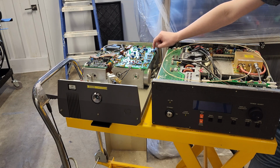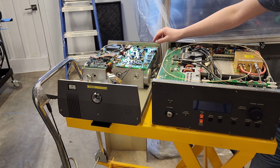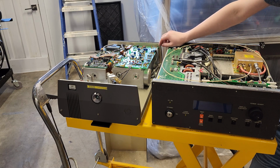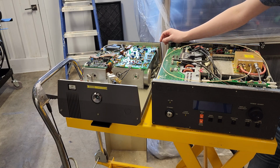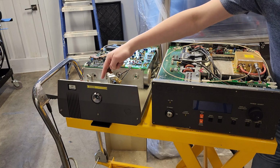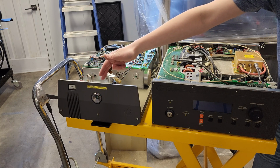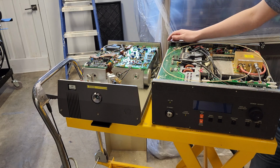This is a mode-locked laser, so it produces extremely short pulses of light, and it does that in a very, very short cavity, a very small distance, and so it produces pulses very quickly. So its repetition rate is 80 megahertz or so. And that's fine, because we want low energy pulses to seed the amplifier, which is behind the camera. Those bounce around inside of here, and then eventually are emitted at an exit aperture, and then routed through a couple of mirrors, and then out of the laser. There's a shutter here which controls the output of light from the laser itself.